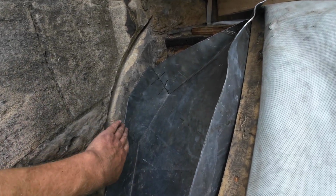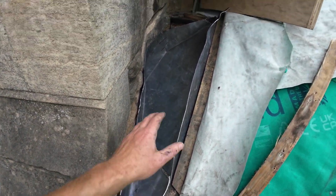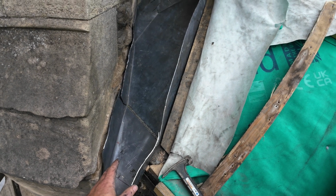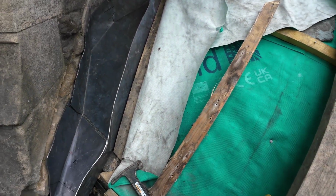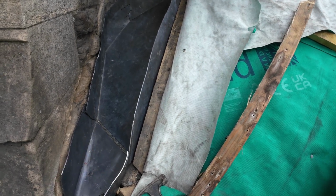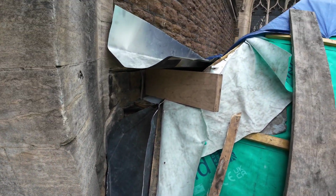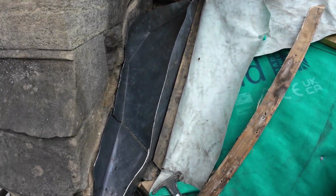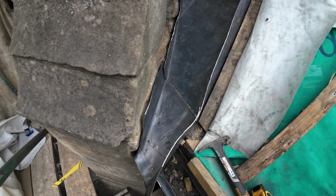And then we've got an upstand there. The old chasers are in here, so we've got a good 6-inch upstand. They're never really good details, these, where you've got a gutter that narrows down into a pinch point. I mean, we could end up bringing it all the way out here and keeping it really wide, but that's a whole other job. And for what bit of roof it's actually coming down on, we've got some good upstands there. We've got 6-inch upstand there, so it should be fine.